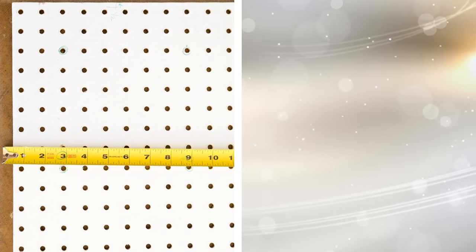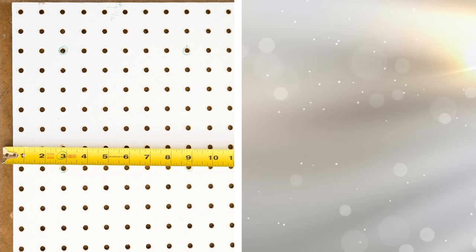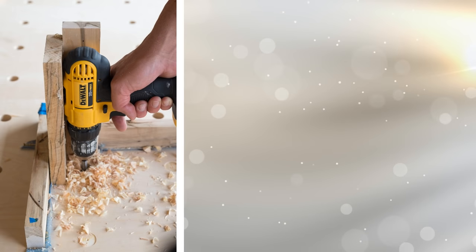Here's how you do it. First, start by figuring out the spacing of your holes and then centering your holes. Stack your wood so that it is all face up, then mark where you are going to drill. When you take it off, it will look like this. Make a jig. The hardest part of this project is making sure that your drill stays at a 90-degree angle while you are drilling the holes.